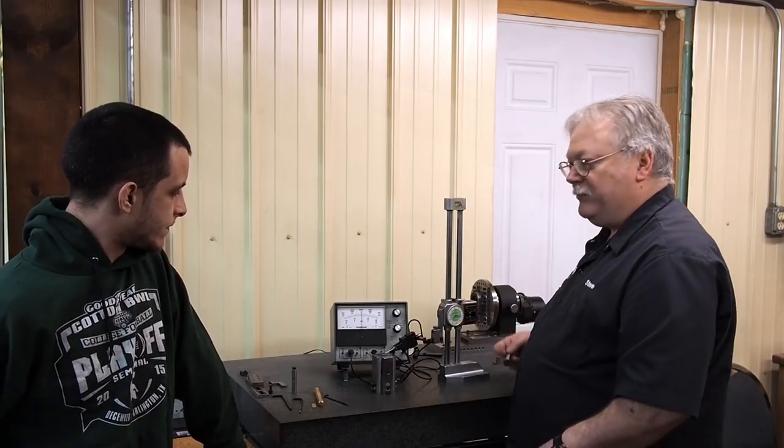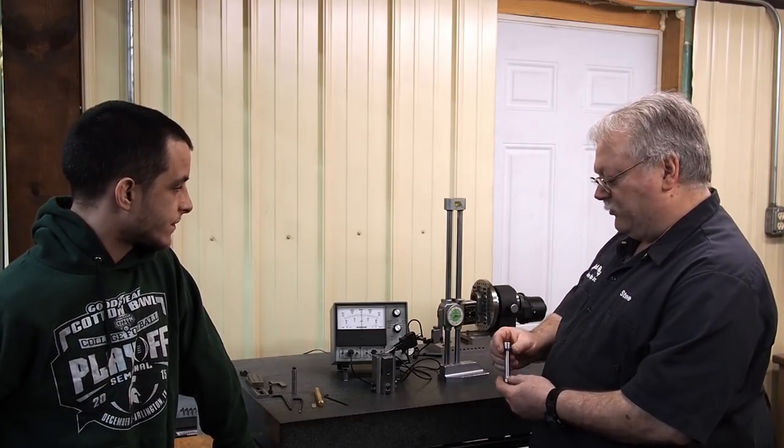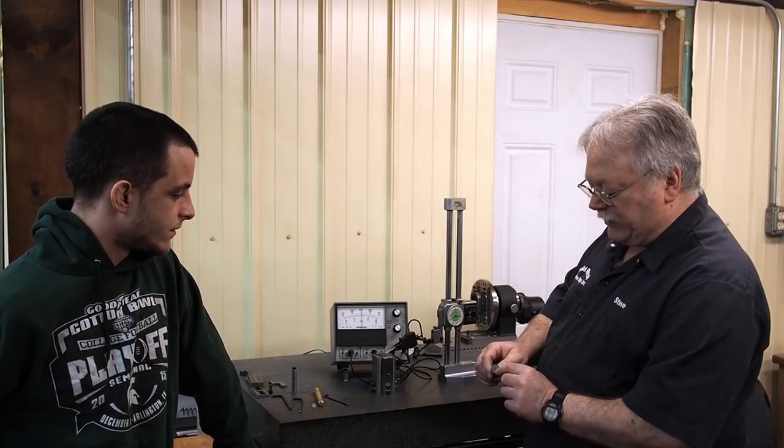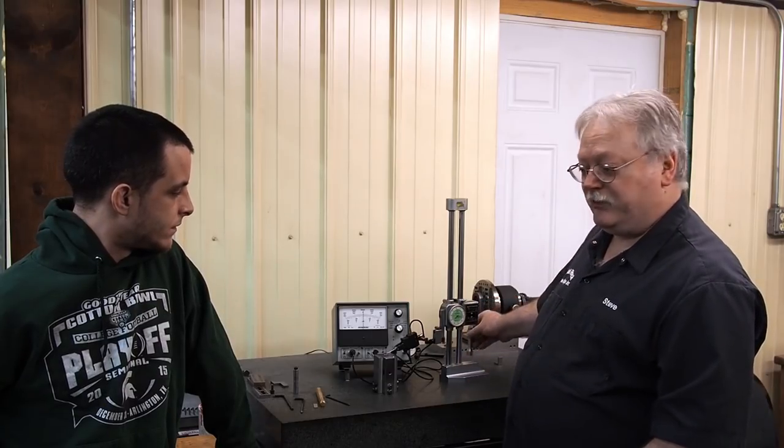So, anyway, Mike, do you have any of the parts? Did you bring them this time? No. Okay. So, anyways, we know the sizes that we got to hit, and we're going to set up the surface grinder, and I'll show you how I set that up here in a moment. We pull the wheel off. Some of you that watched some of our previous videos, you've seen the unit before. We're going to get this all set up, and then we're going to try to get this gauge ground out for Mike, and we'll use gauge pins to measure everything.